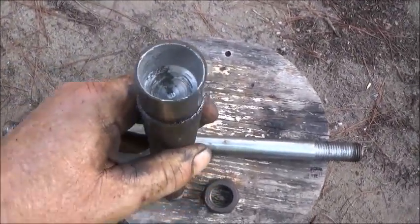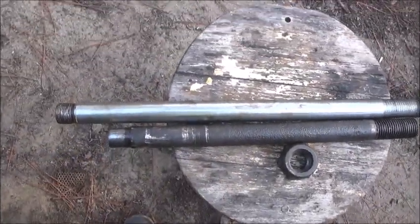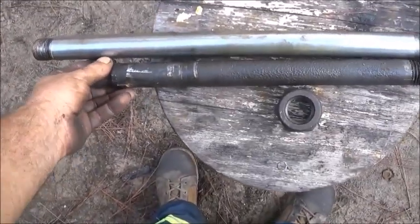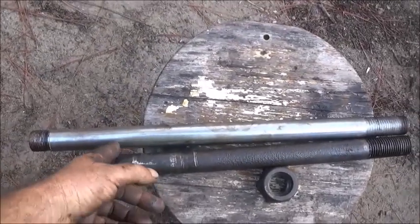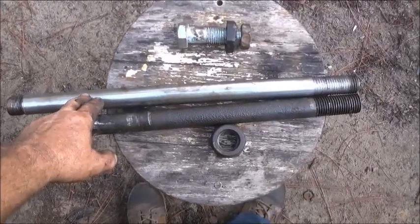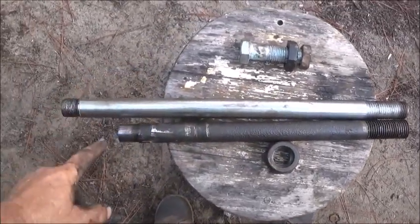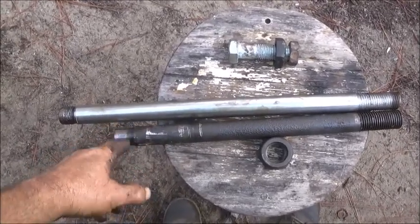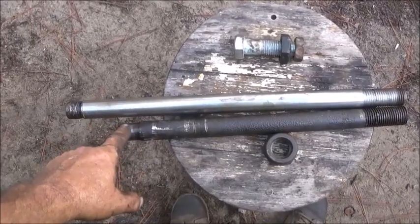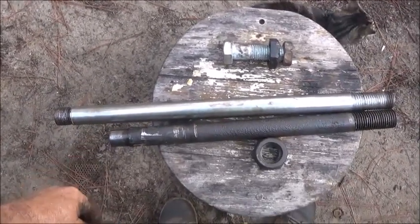That thinned that wall up really good so I was able to go ahead and get it pressed out, and that way I can still get my size off my piston anyway. We've got to shorten this rod up, then turn it down and thread it. Chucking this in the three-jaw chuck, I've got a piece of copper that I've been wrapping around it and then chucking into that. You just got to be careful when you cut your threads — you don't want to cut too deep because you won't get the grip strength you would if you were gripping straight to it.